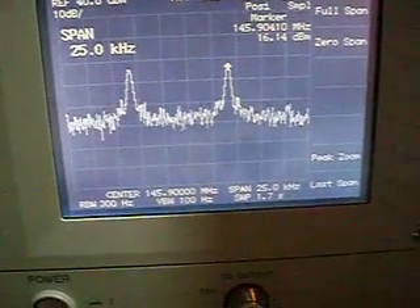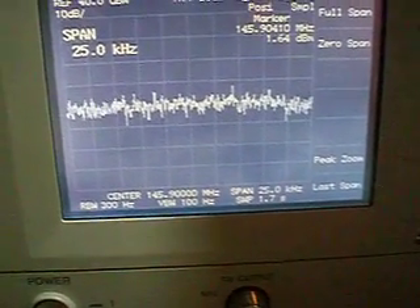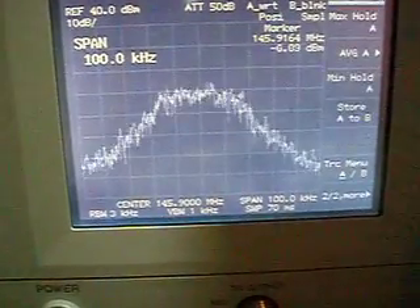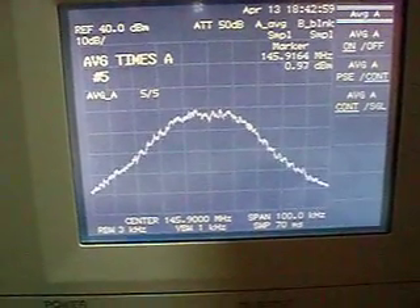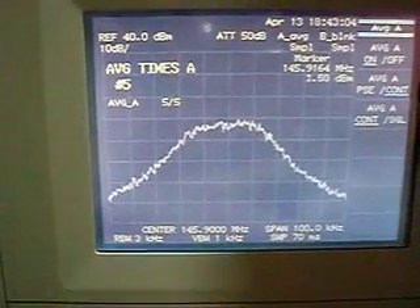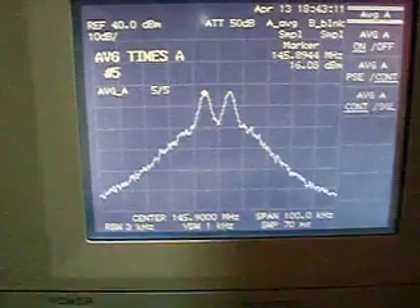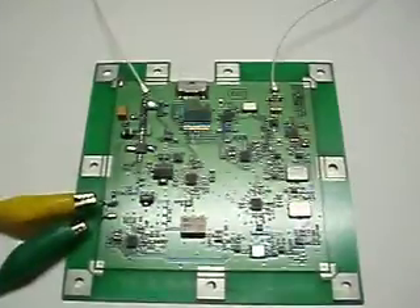When I disconnect the signal, you can see it's quite flat. At 100 KHz you can do some averaging. You can see the bandpass is very flat. I will put in both signals again — there they come again. So this is a two-tone test of my linear transponder.